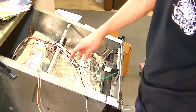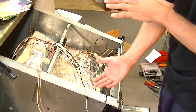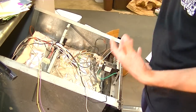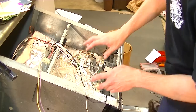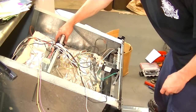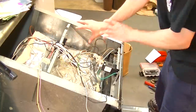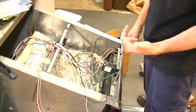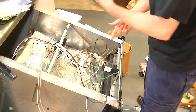They will go in here. I'm going to use the broil element and the lower element - both top and bottom elements - in unison. They're both going to come on at the same time so it'll have even heating. I'm going to keep the light and the little fan here that circulates air in the upper compartments - I'm going to keep all that stuff intact.